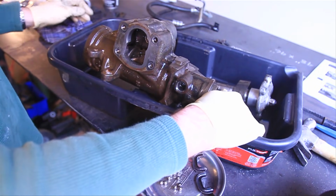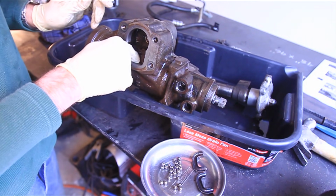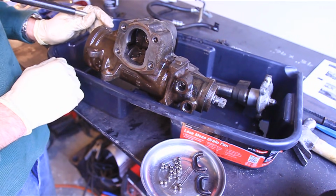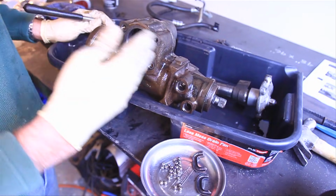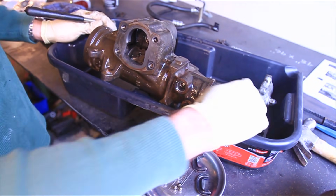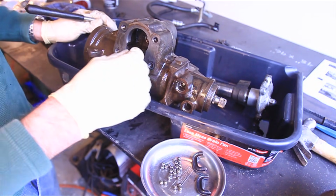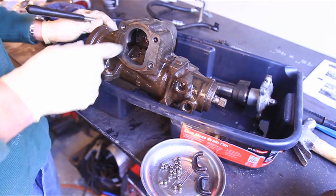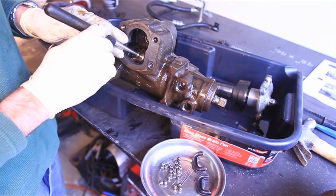So what we've been doing is using the magnet to remove the ball bearings out of the two holes that the cage or cradle was sitting in. And we've been moving the piston back and forth in the casting using the input shaft, which turns the worm gear, which moves the piston back and forth. So as we turn the input shaft, it actually rolls the ball bearings to the top hole, and we can use the magnet to collect them.